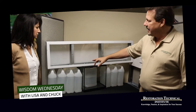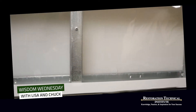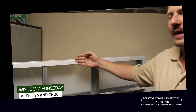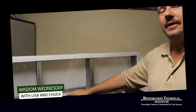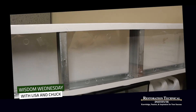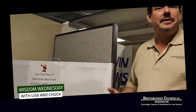The biggest issue is this bottom track. This particular bottom track, as you can see, is like a C-channel, so it will actually hold liquid water inside of it. The problem here is that if you dried ASD style, you can actually have testing of the drywall being dry, but the metal track still contains water in it. That water will re-evaporate on the back side of the drywall and then the paper will wind up with mold growing on it eventually.